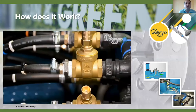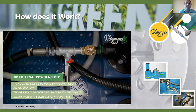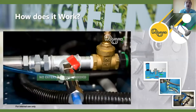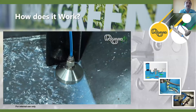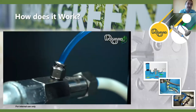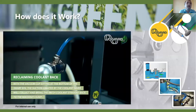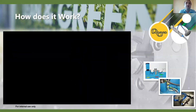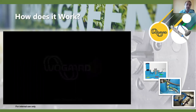It can be used on various machining centers — whether floor-mounted pumps, waist-mounted, or even head-high pumps. It's just a case of locating the relevant pump. The vacuum cup is fully filtered with a micro-mesh filter, so it can sit in the swarf. We do recommend putting it inside a vacuum protector for easy removal when the bin is full. The main areas of concern would be grinding dust or cast iron, where additional filtering may be required.